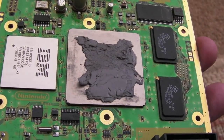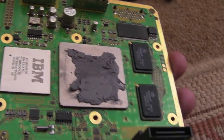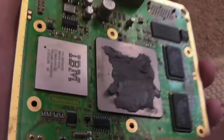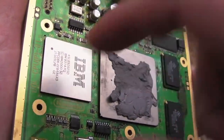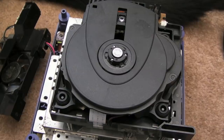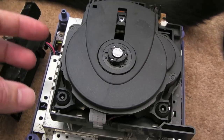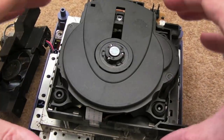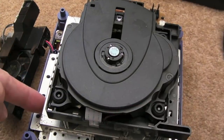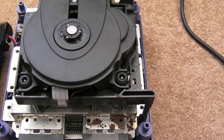I might just remove it anyway just out of interest. Now we know that's definitely 100% the fault on this board — well, there could be another fault. It could have been put into storage after it failed and then some corrosion got under there and caused a secondary fault. But I think that's actually the fault — it's just been put in storage because it's a bit beaten up and scratched, maybe the laser's not perfect on the optical unit. So I'm going to use the original purple shell here and reassemble. Using the drive from the purple one and the motherboard from the black one which works. I'll clean up all the shielding and just show you the end result.